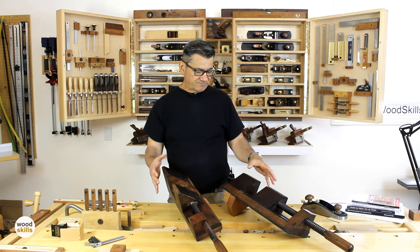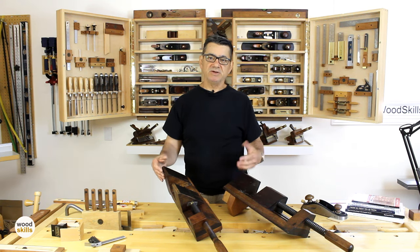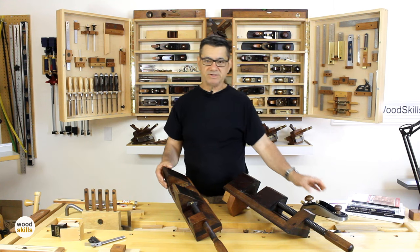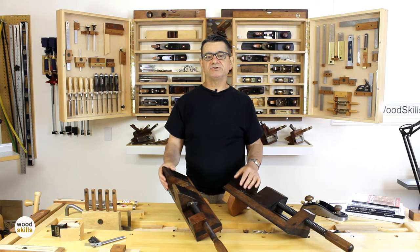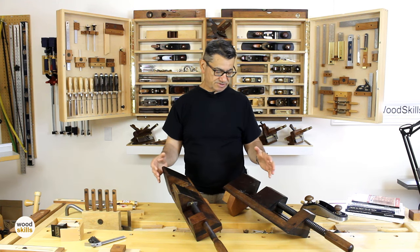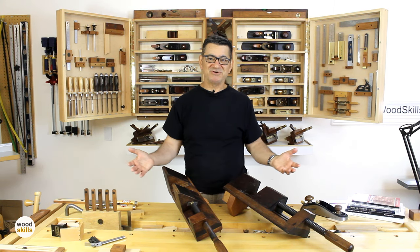They can both be configured on an end vise or a face vise, and I'll show the different configurations and orientations to be able to work better with hand planes. Again, I've already discussed the large miter plane that I'll be demonstrating. And in subsequent videos, I'll be demonstrating angled and straight tenons. I'll also be demonstrating using a wide paring chisel to trim the tenons. So I'll show how to create tenons at 45 degree angles, and to trim the tenons later. So enjoy.